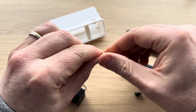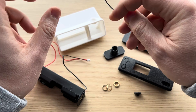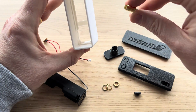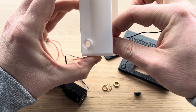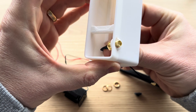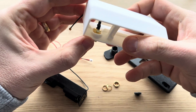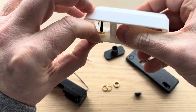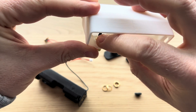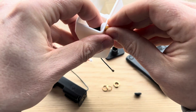First step: it's generally best to put the SMA connector in. Undo your nut and take your washers off — try not to drop them. On the top connector variant, you need to bend it in slightly, so it's best to go in through the back, then tilt it and push it up. The nut on the back of the SMA connector is captive — it slots into a hex-shaped recess, which stops it from spinning when you tighten the nut.